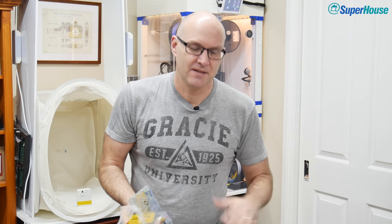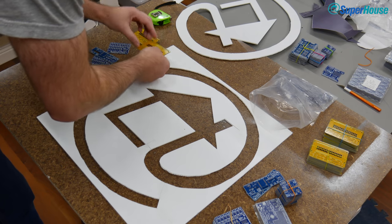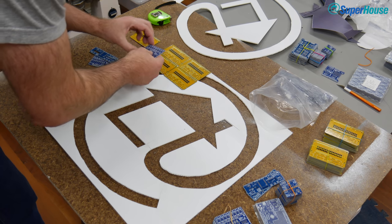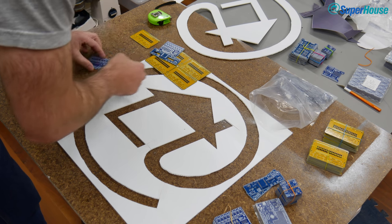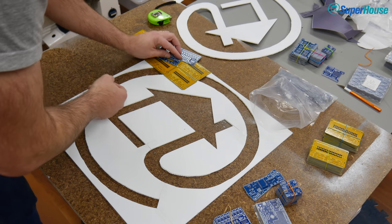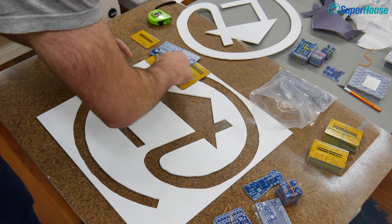So the logo is the space and then backlight it. That way we've still got the classic backlit logo illumination that every YouTuber has to have, but it's just got a little bit more flair. My vague and ill-considered plan is to take a bunch of PCBs and basically line them so that they form a panel big enough to cover the logo. Then I'll take another set of PCBs, overlap them at a slight diagonal, tile them so they cover the whole area, and adhere them together — basically making plywood but out of PCBs. Then I can put it into my CNC machine and use that to cut out the shape of the logo.